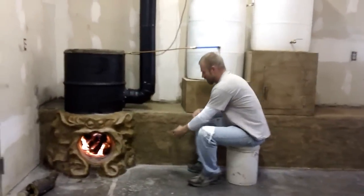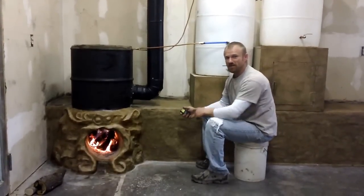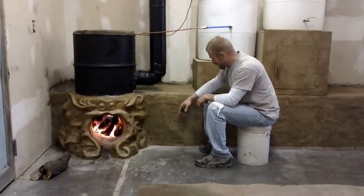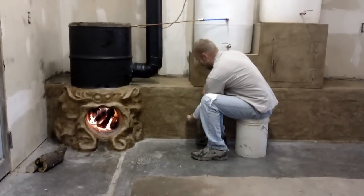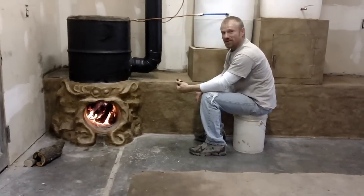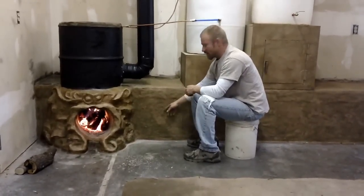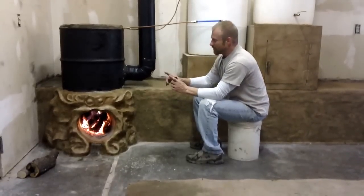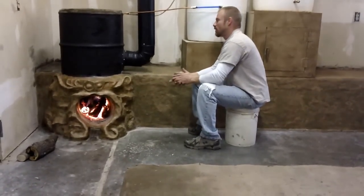Right here is where the clean-out used to be. I would contend that if I shoot a temperature and it's warmer right there — where it's thin and that heat can come to it — it'll probably be warmer than the spot right next to it, and that'll prove that heat's coming into that bench. Right here it's 56.2 degrees, and right there it's 57.3. So it is, to some degree, coming in there. And there's insulation there — so that's just what's bleeding through that insulation. The heat is indeed still coming into this bench.